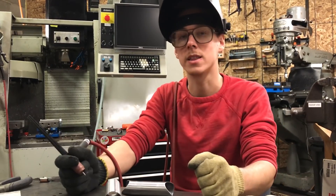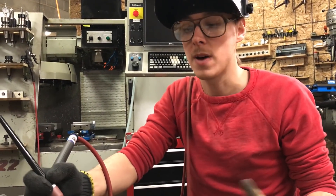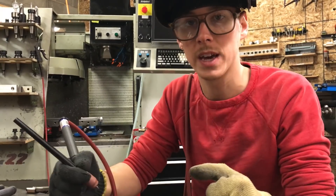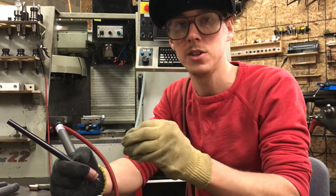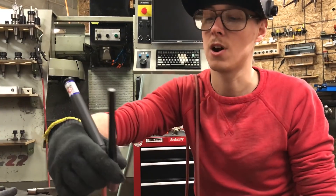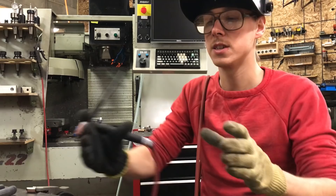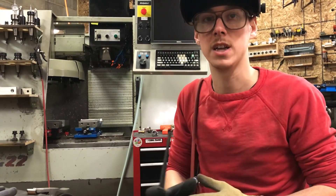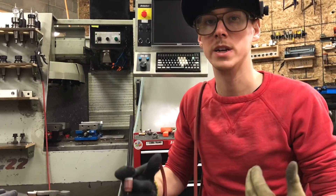The whole point of this is basically to practice, maybe try new things, or just get comfortable if you're new to this — and then assess. Think about what worked and what didn't, and how you can do it better. Maybe you notice you're dipping your electrode all the time — then you really need to focus on that one thing and drill it. Maybe as you dip the filler rod into the puddle it freezes at the edge and you get stuck. Maybe you're undercutting the weld, or your starts and stops aren't clean. Maybe you're having a hard time following right along that miter line. Whatever it is, always think critically. This is an opportunity for you to fail with no consequences. You can make a terrible weld. It's really about just trying to grow — it's not about doing your best work every time. It's about growing so you can learn the most. Think critically before, during, and after the welds, assessing what went well and what didn't, and then correcting from there.